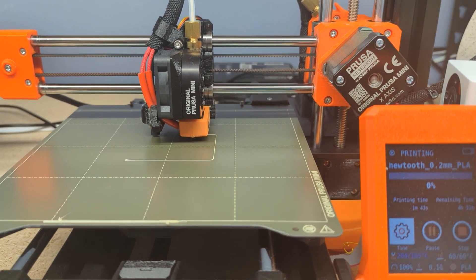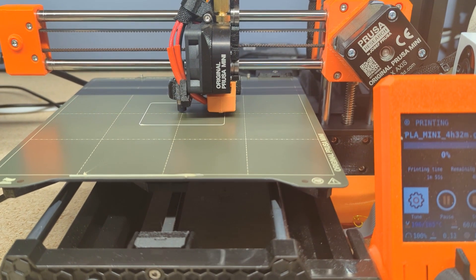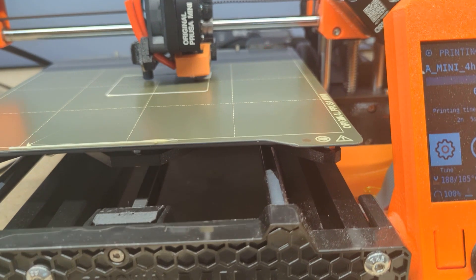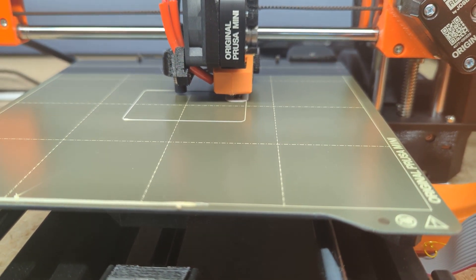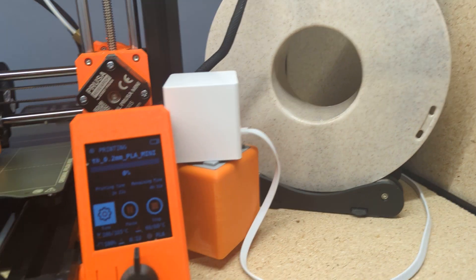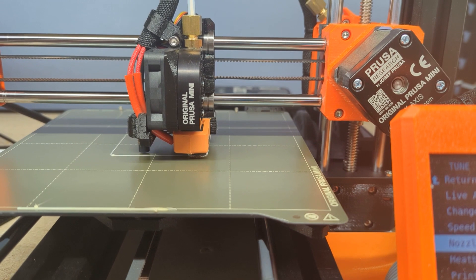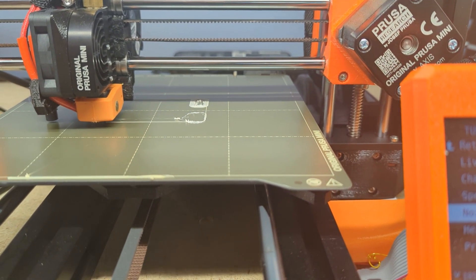I'll let it go for a couple passes and make sure nothing's going wrong, then queue up the time-lapse. This item has a small skirt around it — there are four legs on it, so we'll do four little skirts and then it'll actually print the item. So far it seems to be going down well even at 185. While this is taking place, let's scan over to that fancy looking spool again. I do hear a little clicking. I do think that temp may be a little low, so let's bump it up and see if we can clear that. I'll go back up to 215.